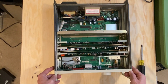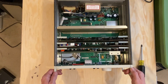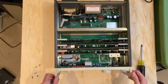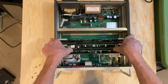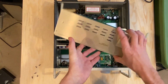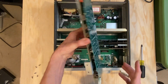My problem is the encoder isn't working, so I'm going to have to get into that panel. Looking here, this is an older card system that some companies probably still use to this day — it looks very well made. These cards come out just like RAM in a computer. You've got to be very careful when touching any parts here — static electricity can take out a lot of these ICs, these integrated circuit chips.